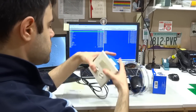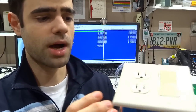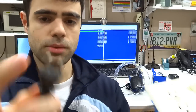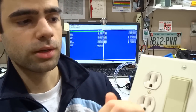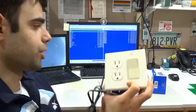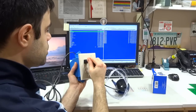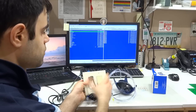I also built this switched outlet — it's all parts from Home Depot: a junction box, an outlet, and a light switch. The cord I got from a TV teardown; it's a polarized cord, making sure it only goes one way into a regular outlet so the switch is always switching the hot and not the neutral. This is very convenient for using on a tabletop with this pump — I just plug this into an outlet, plug the pump in, and whenever I want to turn it off or on I just flip the switch.